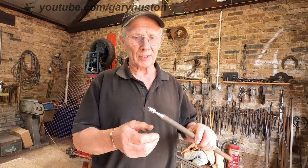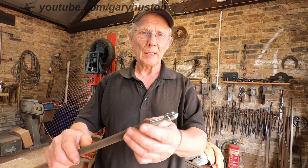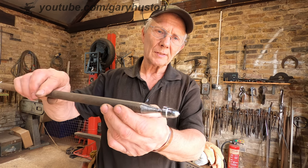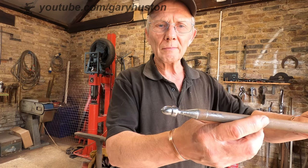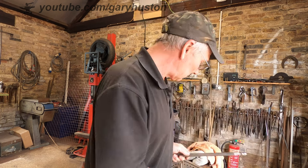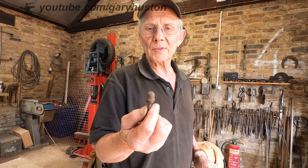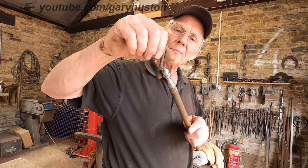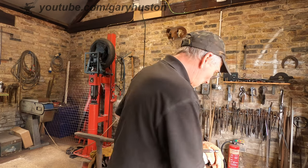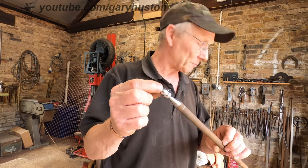What you're going to need — what I've already done — is I've made the pattern. I did this on the lathe. But if you haven't got access to a lathe, you can always forge one and then put it up in your drill press. Run your file around it just to finish it off and tidy it up. You want it fairly smooth. This one I've actually polished just to get it nice and smooth.